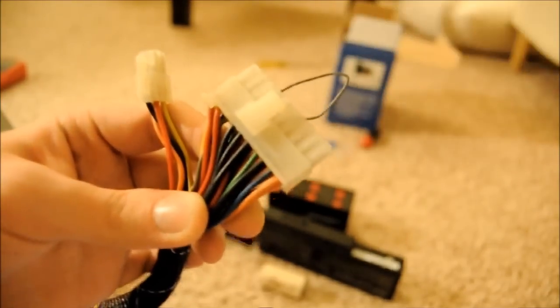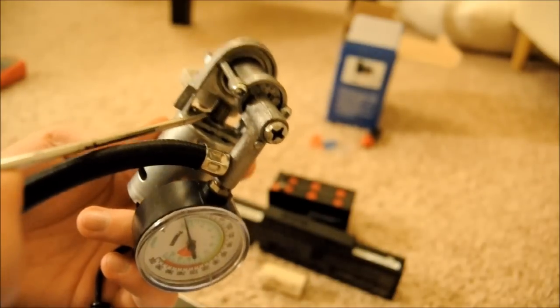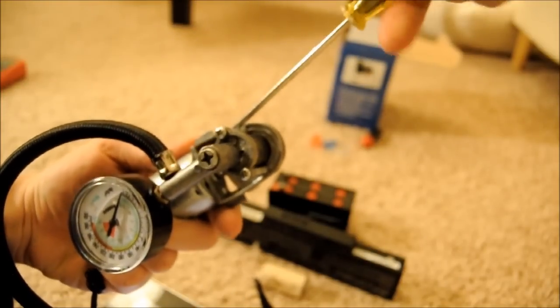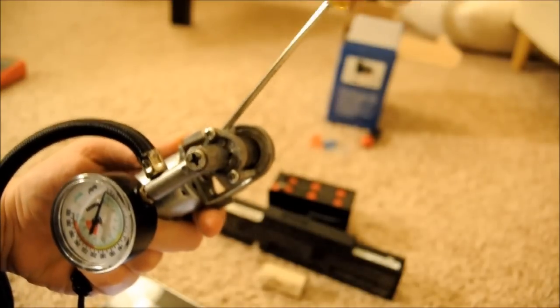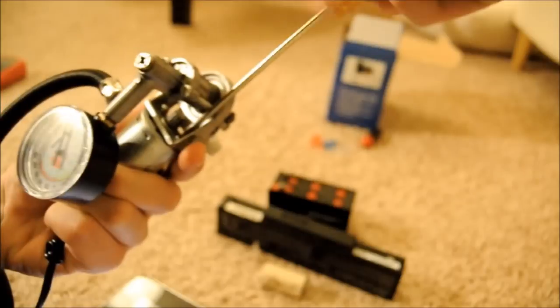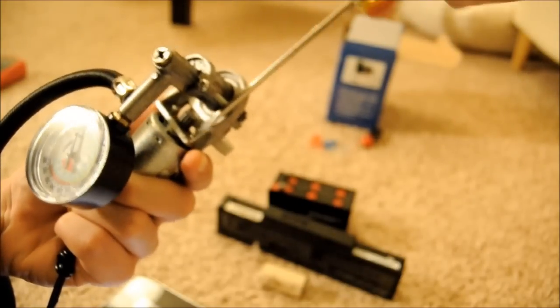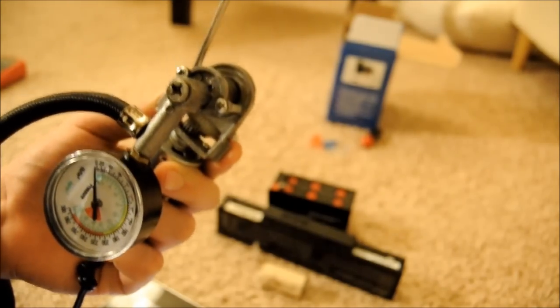If you experience any issue like noise, try to see if the gears are in good integrity. If not, try to fix them somehow. You can also seek a replacement part on places like eBay. If the motor smokes or smells or doesn't run smooth, remove the motor, power it on separately and turn it by hand to see if there is any resistance. In case the motor has failed, you can get a similar replacement motor for as low as $2 and put the spur gear there, but be sure that it will first fit.